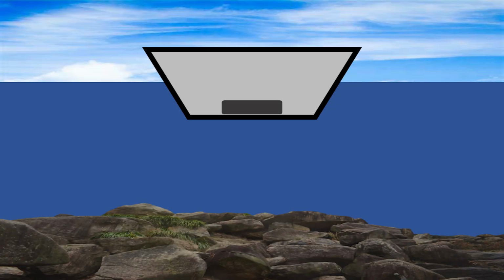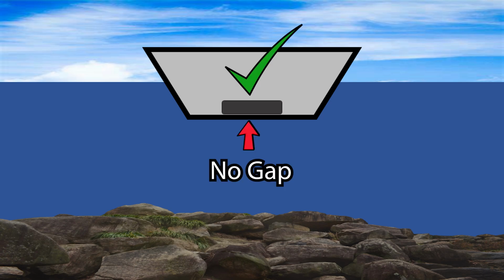One of the easiest kayak hulls to mount your transducer inside of is a flat kayak hull, because the relatively flat surface inside the kayak is an ideal mounting point for your duct seal and transducer. Again, when placing your duct seal, be sure to press it firmly into the kayak hull, being sure to leave no air gaps or voids. The duct seal mounting surface should also be flat and about 1 inch thick.